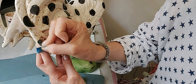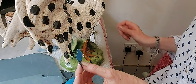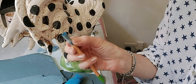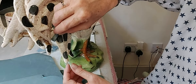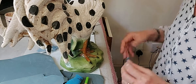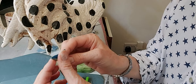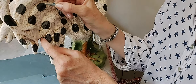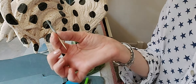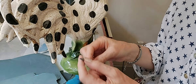When you're sanding something in a crevice, you could take a pen or a pencil and wrap the sandpaper around it into a shape, and then get into those little areas. Also a cocktail stick - what you would do is wrap the sandpaper around it. If you have a join you want to sand that's very tricky to get into, wrapping the paper around a cocktail stick means you can really get in there and sand away. Just be inventive.